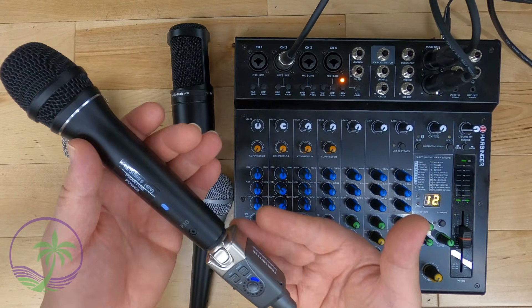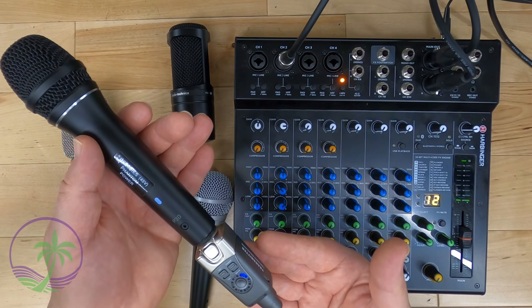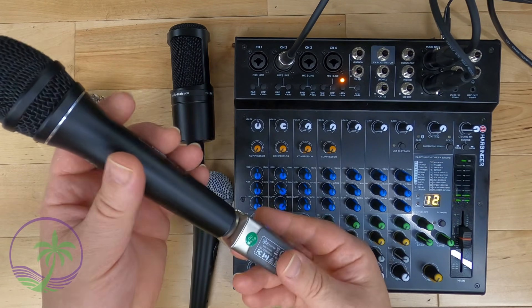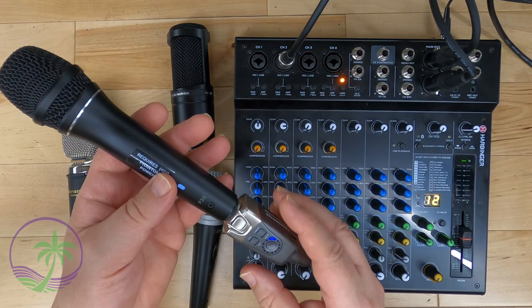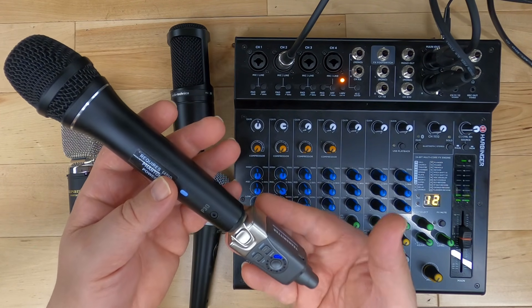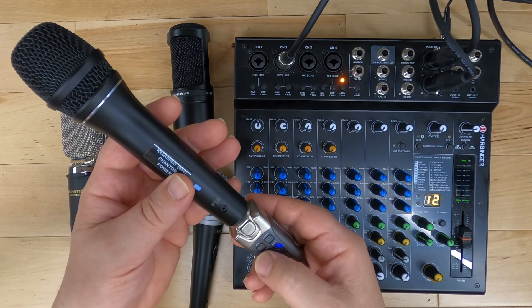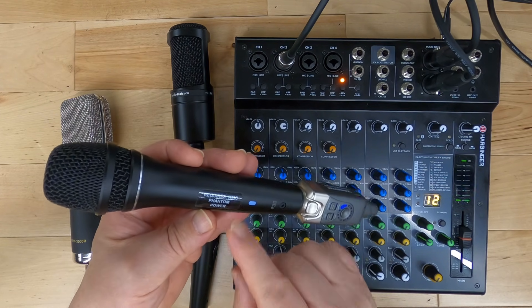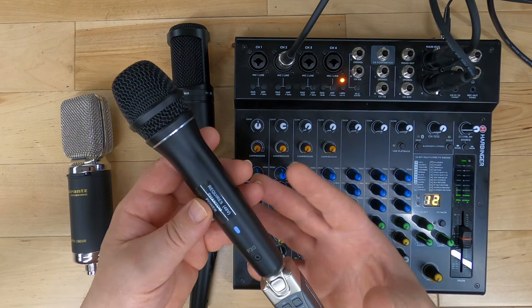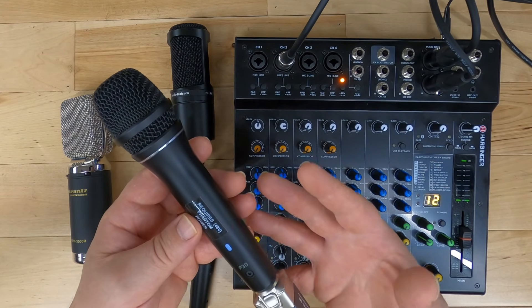But in this case, look at this — this happens to be connected to a wireless system, which normally wouldn't be able to solve our problem. But this is an X-Vibe, and this happens to be not just a U3, but the U3C. And the reason why I have it here — guess what? It has phantom power on it. It has 48-volt and 12-volt settings. Remember, phantom power is not always just 48 volts. It just means there's hidden power in the system to power up your microphone or your equipment.